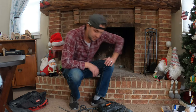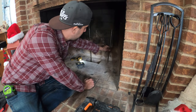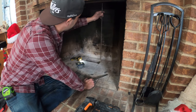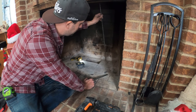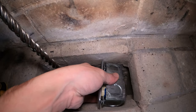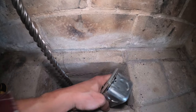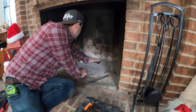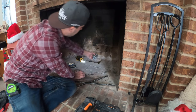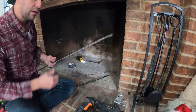Now let's get into drilling. What I was going to do was drill a hole in the back right corner here, probably just go through the mortar, drill with the short bit and then follow up with the long one so I can continue into the basement. But it got me thinking — I have my ash cleanout here, and I think what I'm going to do is just install the outlet box inside there. When they go to plug it in, they'll just plug it in down there. It won't be inside here impeding anything for the install, and then they can just plug it in.